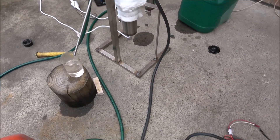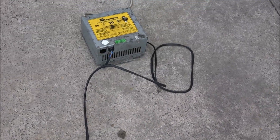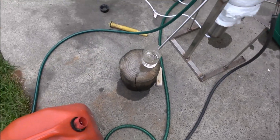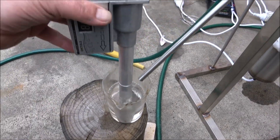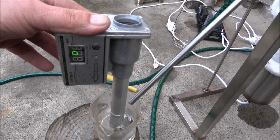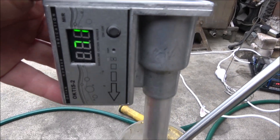Here's the petrol separation. Here's the drum with the mixed fuel — it uses a 12-volt fuel pump supply. Here's petrol again coming out. We're going to the testing system now; the probe needs to be submerged a little bit deeper into the glass, but we'll try to see what it shows. It's showing zeros because there's not enough fuel inside — now it's showing 71.